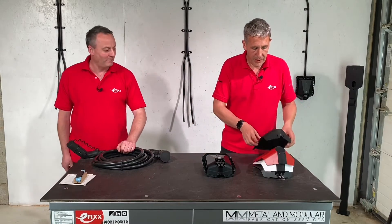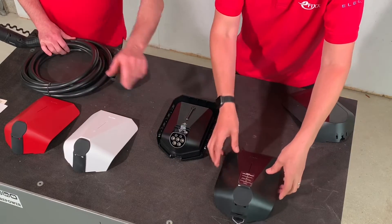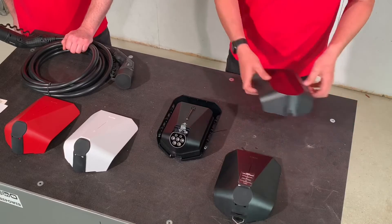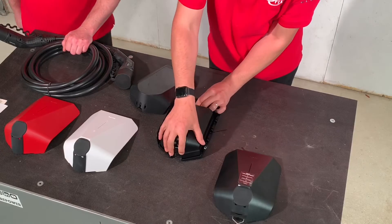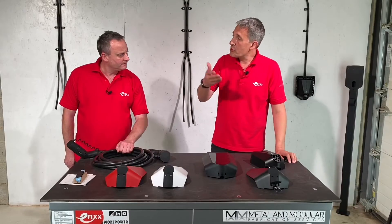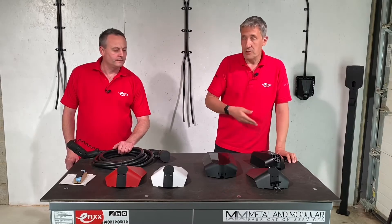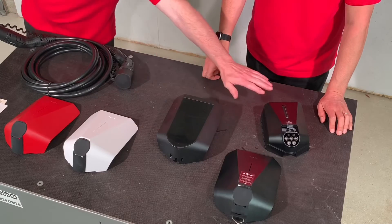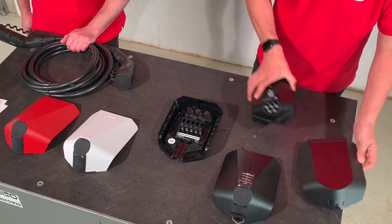Out of the corner of my eye I can see some lovely new versions of the cover. There are colors that suggest this could be Star Wars inspired — I'm thinking the Emperor's Guard, Stormtrooper, and Darth Vader, plus a nice e-fix red. They also do a blank cover that doesn't have a charge unit in it. So on an installation with a hundred charge points, you could first-fix all the bases, put this blank cover on, and come back later to install the charge module — wiring all 40 but fitting chargers on only 20 initially, leaving the rest ready for future growth.